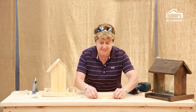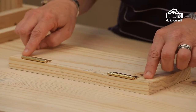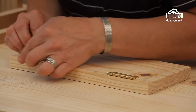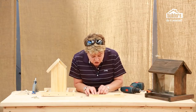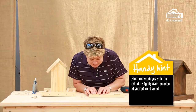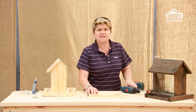Now we're going to take our two hinges and place them onto our last remaining piece of wood. Measure them up, making sure they have the right spacing on either side — three centimetres on each side — and then simply screw them into place. The major trick with recess hinges is that when you're placing them, please ensure that the little cylinder is just hanging over the edge of the wood. It should not be flush. If it is flush, it won't close. So just make sure it's just over the edge. Pop your little screws into the markers and simply secure them.